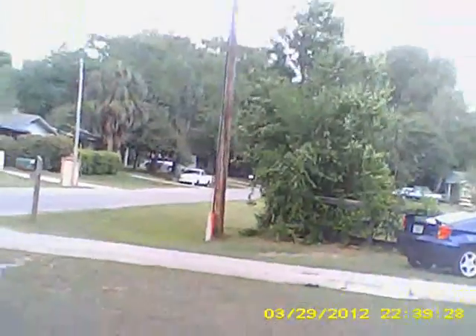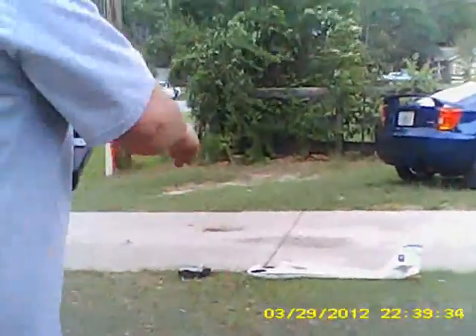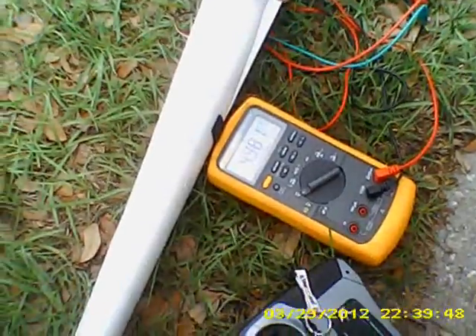Still in range check mode. Let's take a look at the receiver — I believe it's going to indicate some radio dropouts. We still have 4.9 volts there. I've got full control. I'm going to let go of the trainer switch. As I suspected, the light is blinking indicating RF dropouts — at least four dropouts. And we still have a bind light on, so we know we're bound.